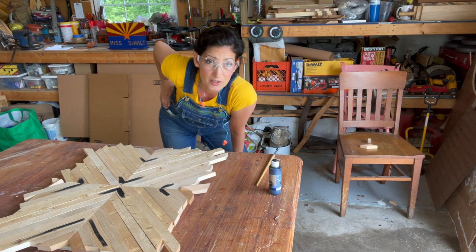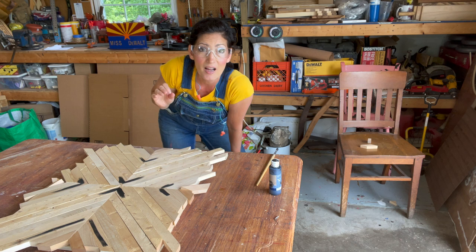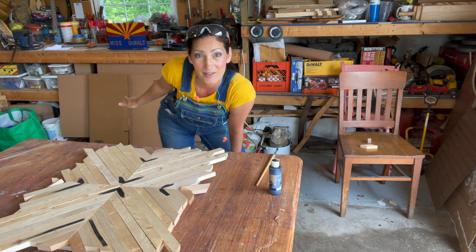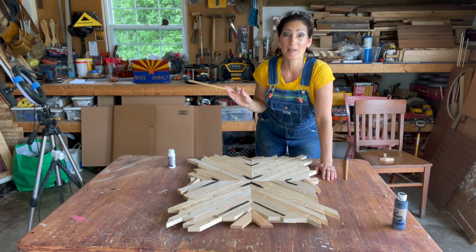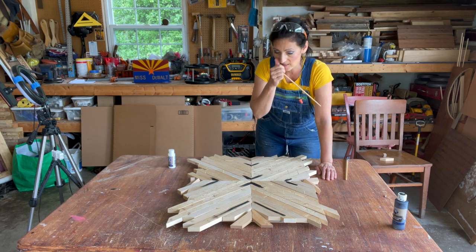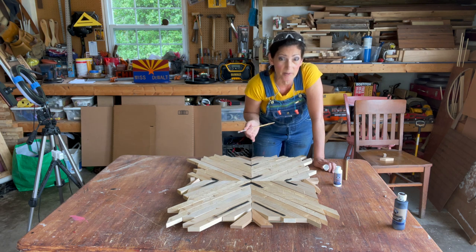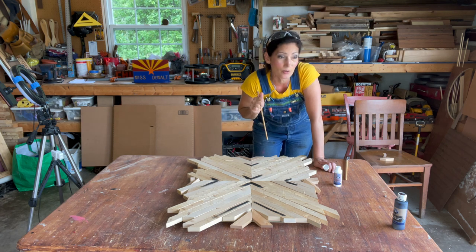This is my first piece. It's good to learn a new skill. This is actually going to be in a Facebook ad to show how much better these boxes are for makers than the competition. But I'm really enjoying it and I'll probably hang this in my home when I'm done or give it as a gift. My pieces are all cut — I would definitely recommend having a stop block, otherwise you'll drive yourself insane. I'm going to go through now and mark which pieces I want white with a little dab of white paint. Then the remainder are what I'm going to stain. After that I'll pick the white ones off, put them on a piece of cardboard in order, separate the black ones, paint them, and then the same with the stain. Then the next thing is to glue them and use a brad nailer.